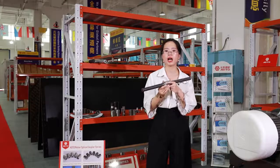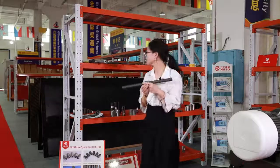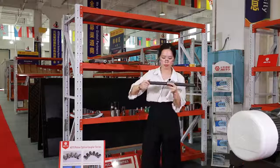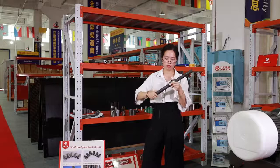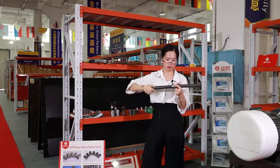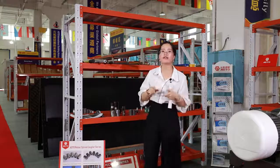If the diameter of two reinforced bars is different, we call it a reducing rebar coupler. This standard rebar coupler is normally used under the slab or under RC column. And this one — turn left is open, turn right is tightened on one end, and the other end is positioned. This one is a positioned coupler, normally used as a steel bar with a bent hook.